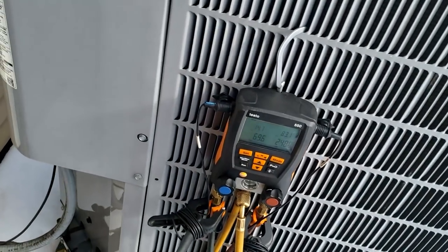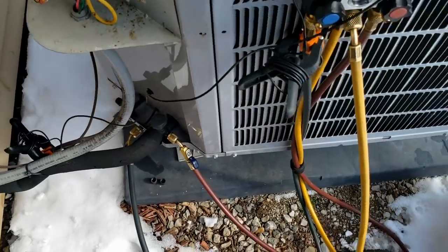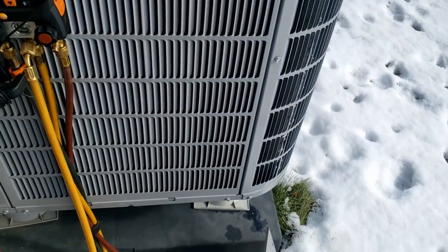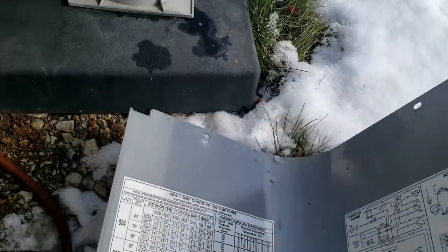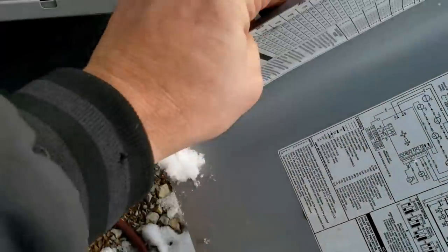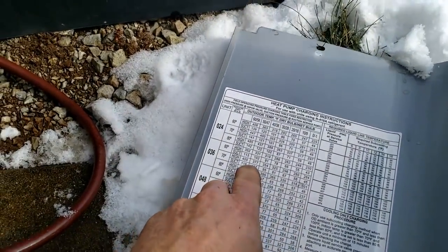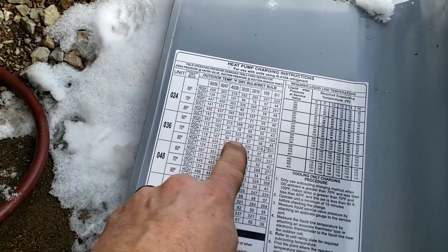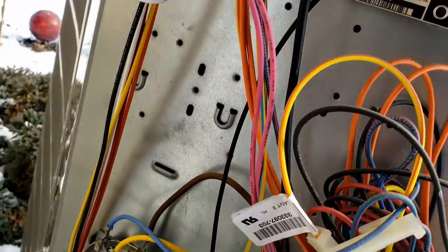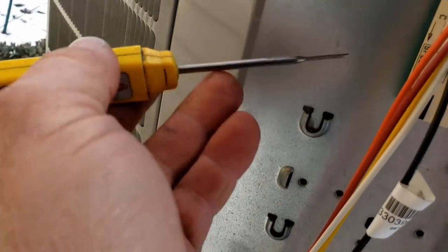The chart says it's gotten a little warmer — it's 25 degrees out now. Of course, right when I'm ready to get started, the unit goes into defrost. This is a 36,000 BTU unit — indoor temperature is in the 70s and outdoor is between 20 and 30 degrees. I need to get it out of defrost, which I don't know why it thinks it needs — this is obviously not an on-demand defrost, so I'm going to speed this up.